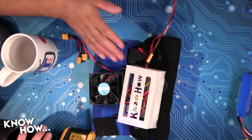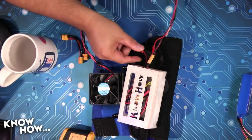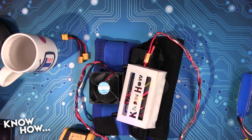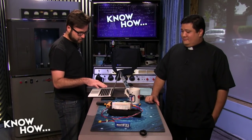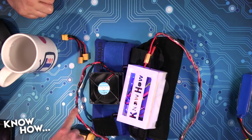This is our Cyborg Cooler. It's a Peltier unit, and this is the battery pack slash control unit that lets me do variable voltage over to the Peltier unit. This is the fan. By the way, I forgot to add an on-off switch. This is a self-contained unit with no external power. It can run for up to an hour with the batteries I have it spec'd with, and provide cooling for your forehead, neck, arm — wherever. You've got about four or five parts all put together: the dimmer, the battery, and connections to the thermal coupler.